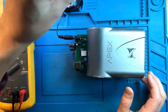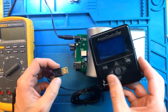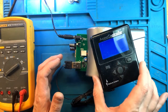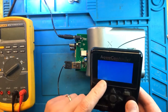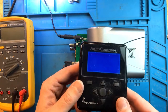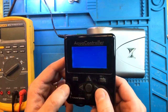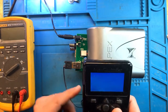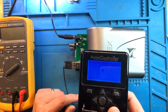Let's plug in the display. The display is on — at least the power is on — indicating that the 12-volt power over Aquabus is actually conducting well. But there is absolutely nothing on the display itself. This indicates that the problem is likely with the CAN transceiver. So let's find that CAN transceiver on the head unit and attempt to replace it.